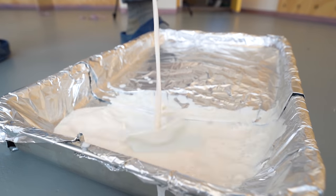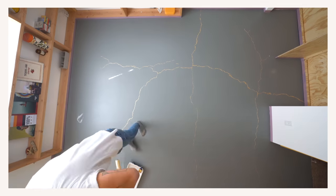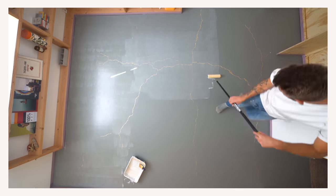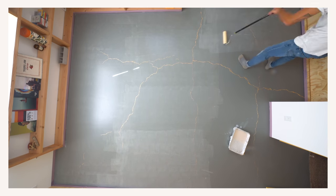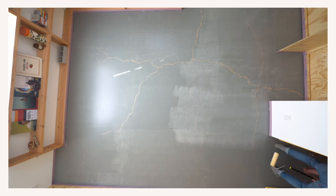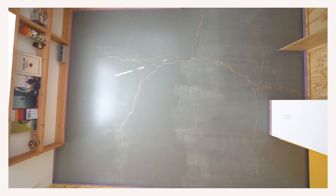The directions say you can apply this sealer with a sprayer, a foam applicator, or a roller up to a quarter inch. I made a huge mistake assuming my three-eighth inch roller would work fine — it's only an eighth inch more than a quarter, but this created a big problem. It ended up applying too large of a coat with dimples that weren't able to self-level. This left a little bit of haze in places, similar to water-based polyurethane that puddles or drops to dry, and in some spots you could see brush marks where it just wasn't crystal clear.